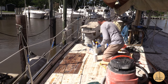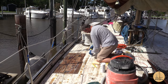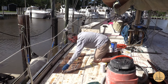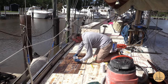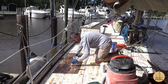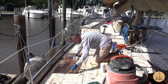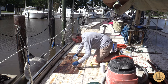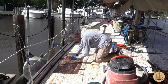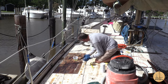If you have a boat and you do repairs, you likely have an epoxy bin, as do I. I got a lot of feedback from folks saying that by doing this it just keeps my thickened epoxy from having the moisture wicked out essentially into the substrate. I had already done this once before on this surface, but I wanted to grind it a little bit smoother, and when I did I removed a little bit of that layer of epoxy. I'm not trying to go thick here — the purpose is really just to give it a little bit more surface to grab onto.